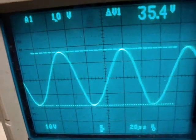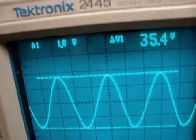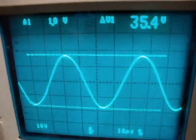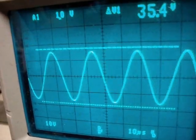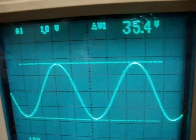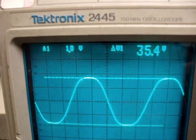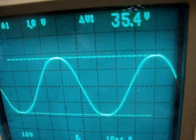There is 10 kilohertz — now we're seeing it. That's 15 kilohertz. There's 20 kilohertz — showing a little distortion, but not bad. And that's where it starts to really roll off; that's 40 kilohertz right there. Back to 20 kilohertz — varying the volume up and down, that's where it clips at full power output.